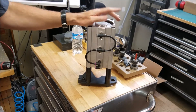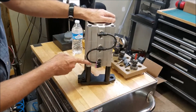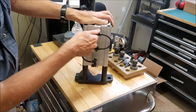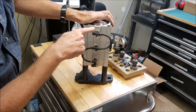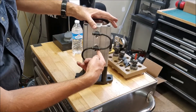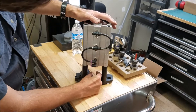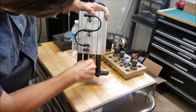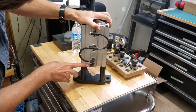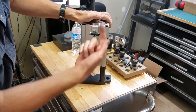One of the key components to the system is the cylinder. This is actually a three-stage cylinder, or basically three separate cylinders bolted together. This I believe is the input line, so when air pressure is applied here it goes into this cylinder, that cylinder, and that cylinder all at the same time, thereby pushing the cylinder down or the bolt down. And I believe this is the return, so when air pressure is put into this one it then pushes all three of the cylinders back up.